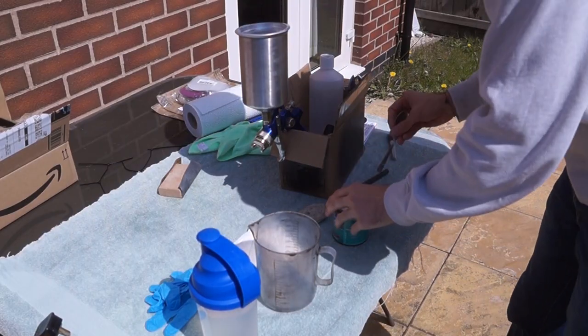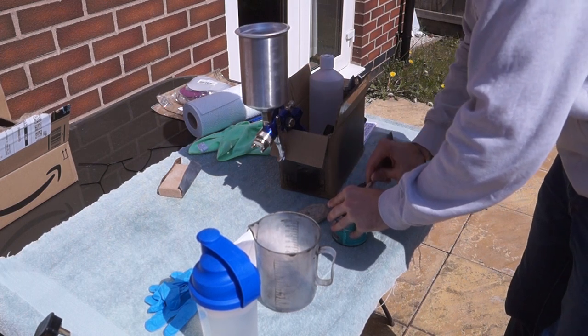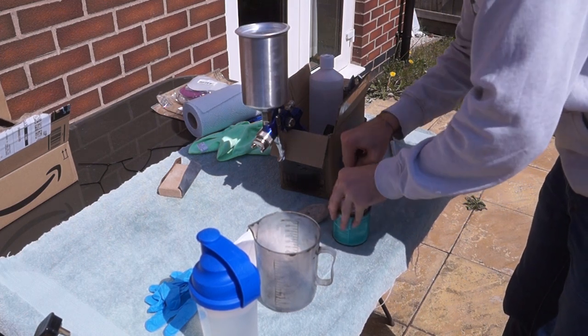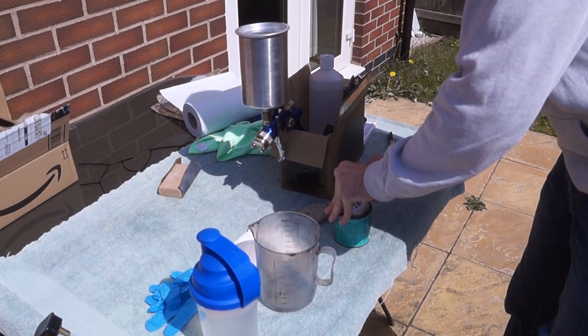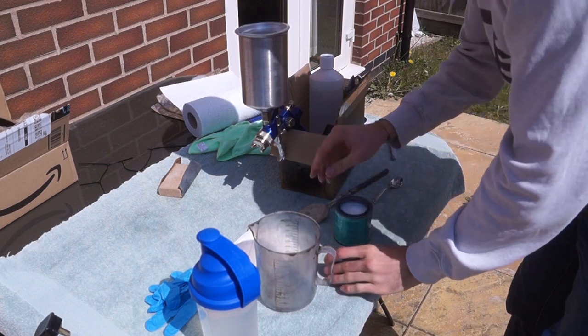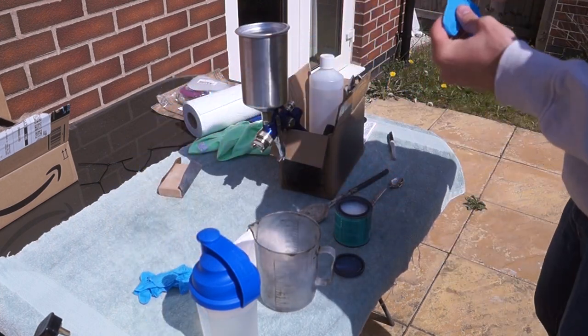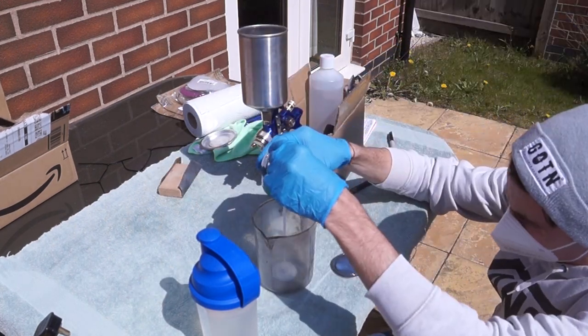All right, day number whatever at this point. I'm going to be laying down some clear coat, and I used polycrylic here, which I really liked using. It's water-based again, so it dried really quickly. And I just thinned it out with the tiniest bit of water to get it to spray. You can find all the ratios and everything online, and I'll put links in the description to all the items I used.